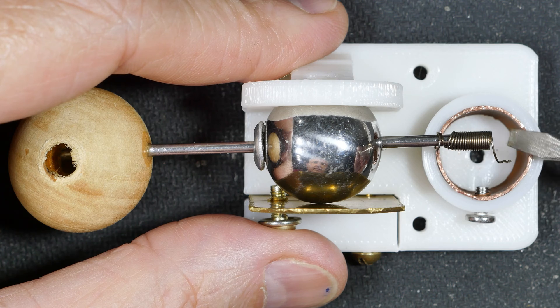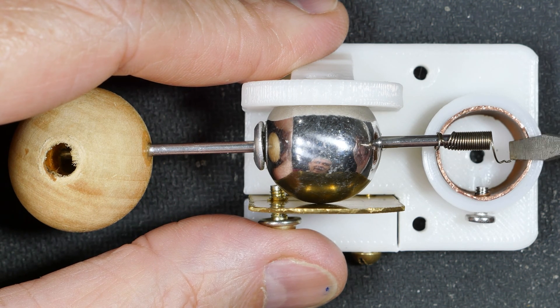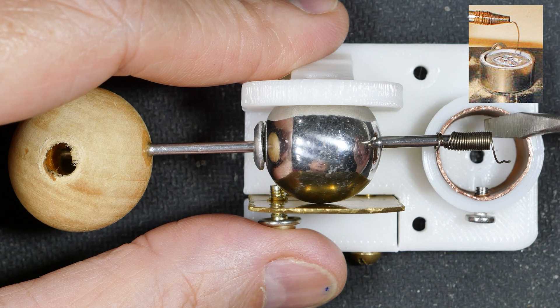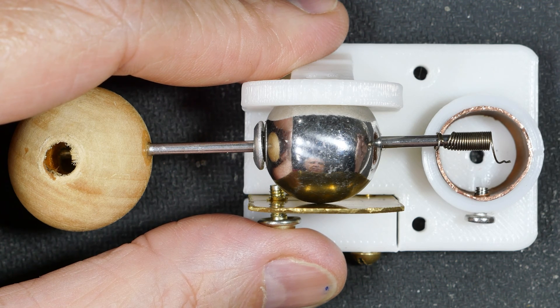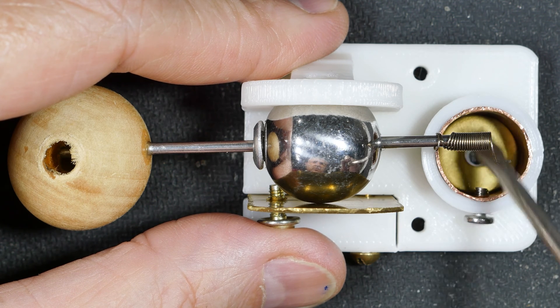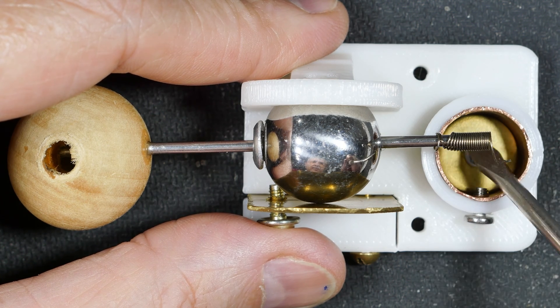When you set the mineral down in there it makes firm contact. The reason I originally did it the way I did was because the ancient crystal radios had a cup — a metal cup, probably tin — and they set the sample inside of it, stuck in lead, probably solder. You'd use two screws to come in contact with that little pot and it would hold it in position. But those aren't available anymore, so we have to make do with our own minerals. You can also throw in a brass washer if your mineral is smaller — it will sit in there, and because the copper pipe was cut with a tubing cutter it tapers at the bottom, so the washer makes good contact all the way around.